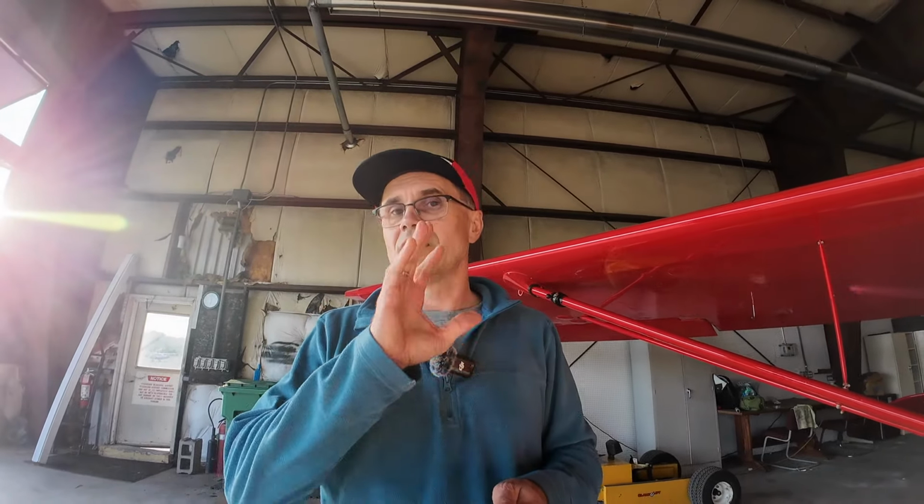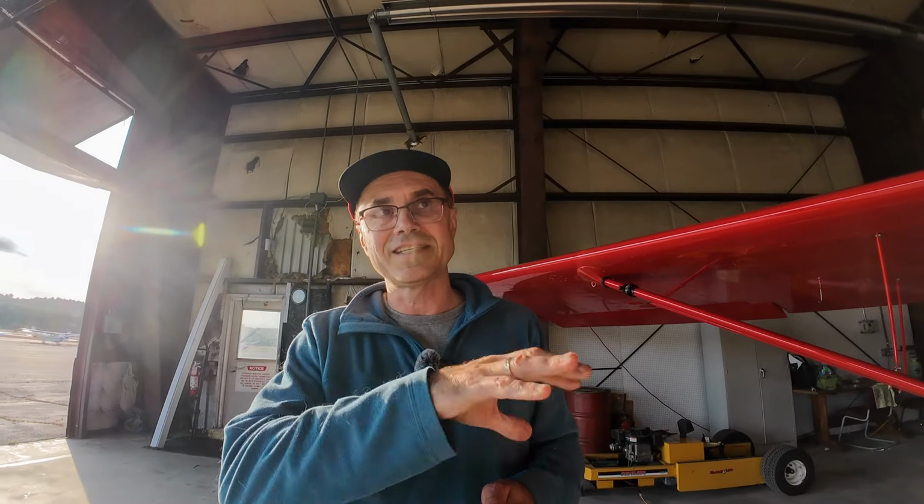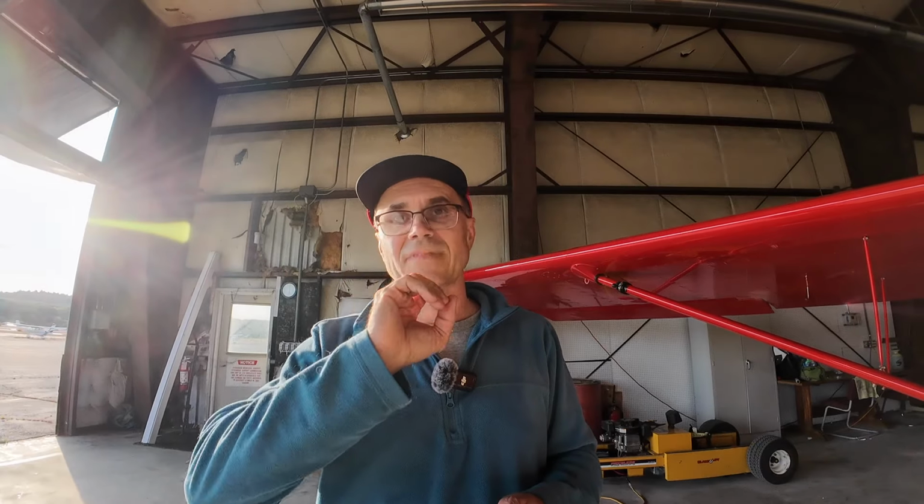And in fact, there are lots of benefits to a fixed pitch prop. One is maintenance. They hardly need any maintenance. Yeah, you refinish them now and then, but otherwise, you don't have the constant speed hub and the oil system and everything else to worry about, and the seals out on the blades, etc. So none of that. It's a lot less expensive, obviously, to begin with, and then it's much, much less expensive to maintain, because you pretty much don't have to worry about it.